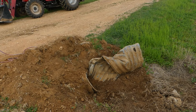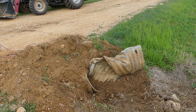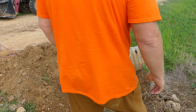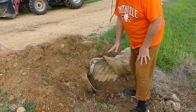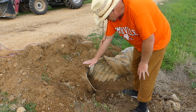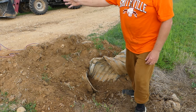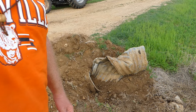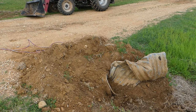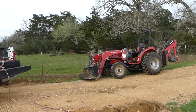We have the leftover of about a three-foot section of missing culvert. I tried to use my backhoe and bend it back in shape, and it's not going to work. So what I'm going to do is cut it off right there, use rebar, build this out so water will run. The same thing on the other side — it's a little too tight of a corner for trucks to make, so they've run over the culvert. I'm hoping a little rebar and some concrete will fix that up.